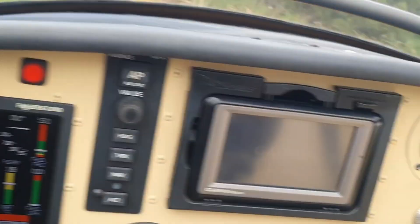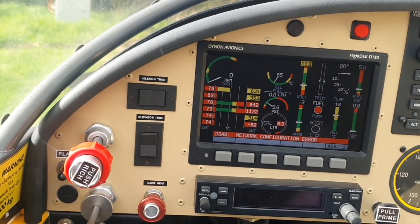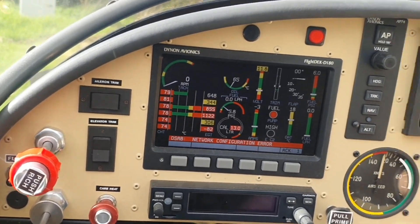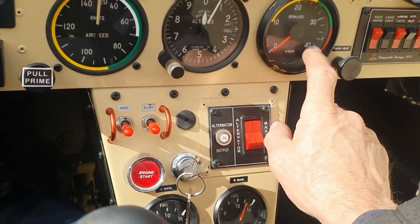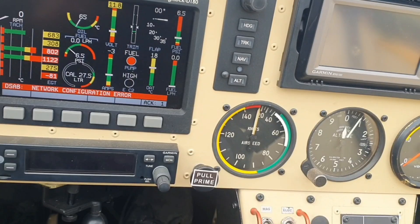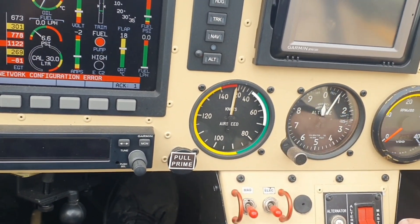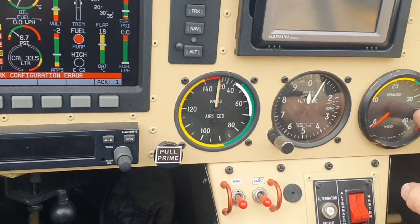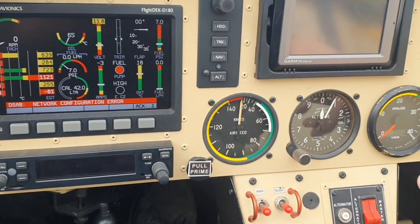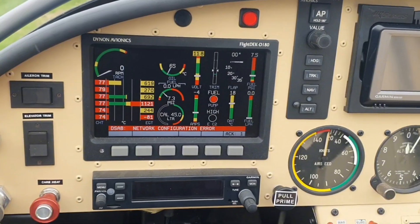Running well, temperatures are good. We re-pitched the propeller a couple of degrees so that at wide open throttle it's only just kissing 2800 RPM, which from experience is a good starting point. We've added about two degrees of pitch and made all the blades the same with an electronic protractor. It seems quite happy — maxing out at full power at about 2800, so that'll be a good starting point for the next test. 2800 static on these things is pretty typical but it needs a test flight to confirm.